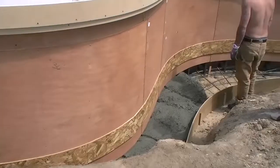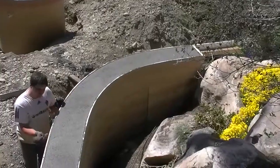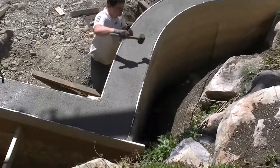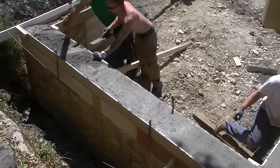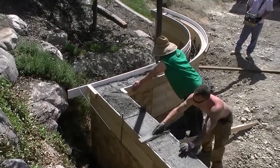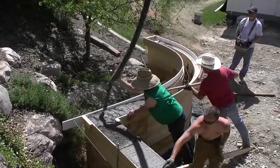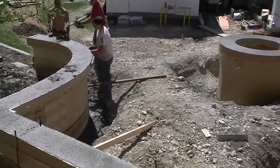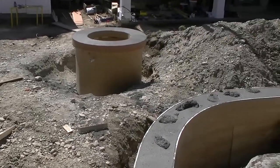In some places, we put an exterior form board up for the footing so that the concrete wouldn't go any farther. In all cases, you'll want to consolidate the concrete using a vibrator or tapping the exterior. This step eliminates any voids or honeycomb. The mix design is everything. If you get the mix design properly, the concrete will flow just beautifully. And as you see, there's extra concrete we put on top for later to finish it off because of some of the settling from the tapping.